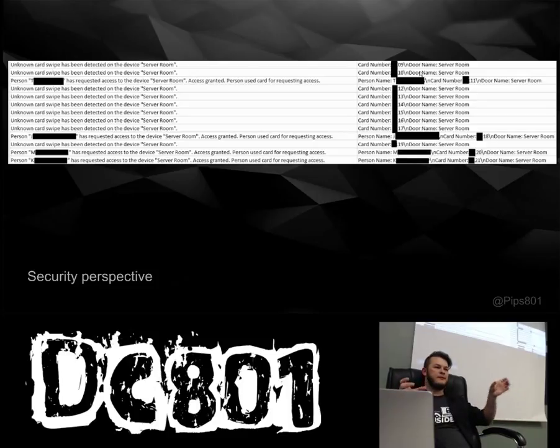So there's your facility code, which is kind of like your separator, and that code kind of bases what your card number is on. So a facility code of 33 and a card number of 1009, 1010, 1011. Once you know the range of cards it's going to be in, once you can scan one card that you know is going to open a door somewhere in there, that card may not have access to anything. That could be a terminated employee card, which is kind of a scary thing too, because you could just find some employee who maybe has a grudge and say, dude, let me buy your old access card for 20 bucks off of you.